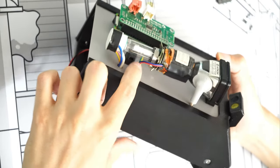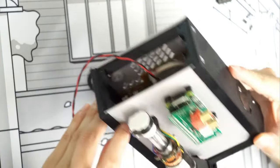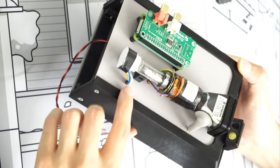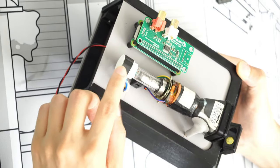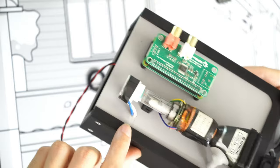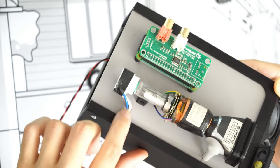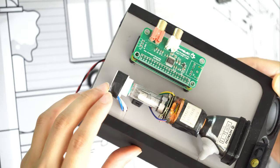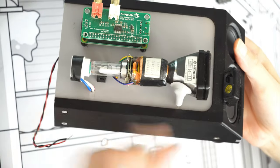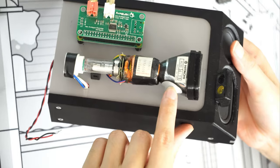All the wires for the yoke go through here. To have the wires pass through, I had to dip the connector and pass the wires. And to pass these wires for the neck plug here, there's a little slot that has a piece of plastic slide in to make sure that the cables are not loose and to make it look cleaner. Same thing here for this one, which is the anode cap.